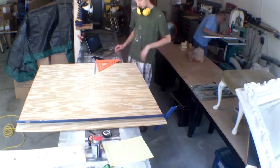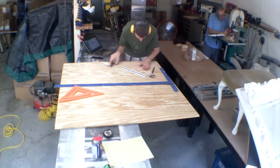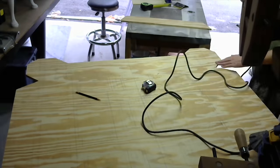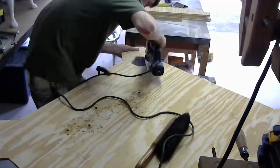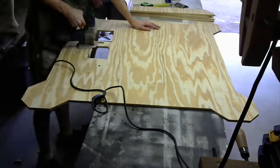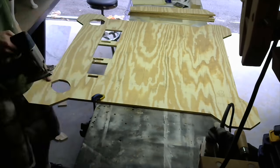I wanted. Using the 3D render, I got the measurements from the model and basically just drew it out on the plywood, same as last time. After I was done drawing, it was time to cut the frame out. This time there was a lot more cutting, which naturally took longer. It took about 3 to 4 hours to cut out the entire frame, making sure to also smooth down the edges with the file afterwards.